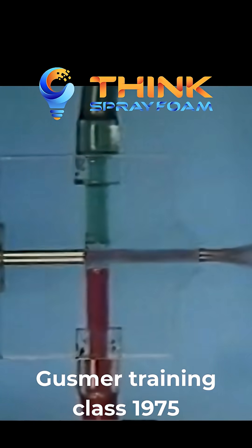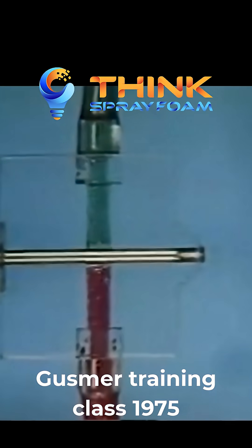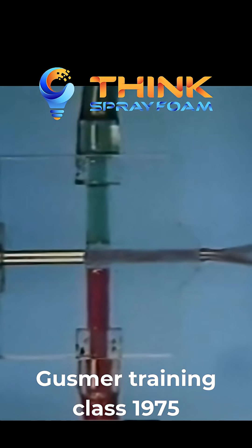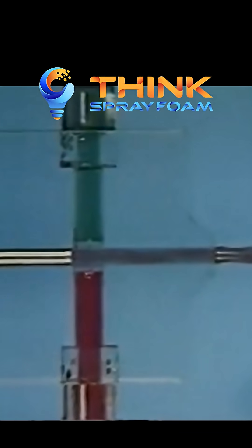This visible model mixing chamber shows that the two materials, here represented by red and green, are kept separate by a movable valving rod, which upon actuation of the trigger withdraws from the mixing chamber and uncovers the material inlets, allowing the two liquids to simultaneously rush in. The injection force of the liquids as they enter the mixing chamber from opposite but slightly offset injection slots causes a combination of impingement and rotary motion, simultaneously mixing the two liquids and creating airless atomization into a spray pattern.